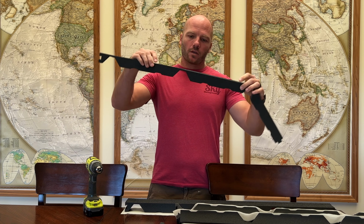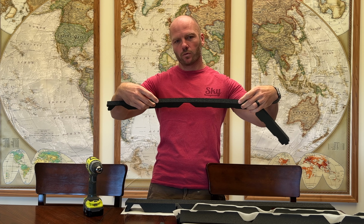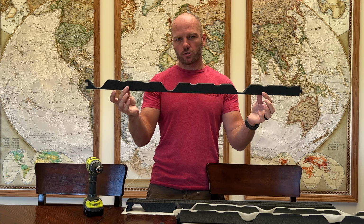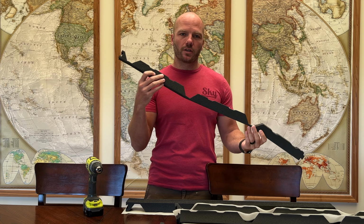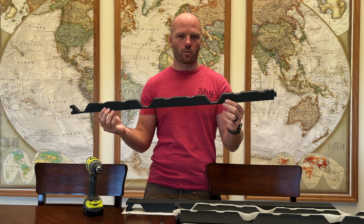On today's episode, we are going to be installing some ridge cap closures on a metal roof. These closures are the little foam pieces that fit underneath the ridge cap to keep water from getting blown up underneath the top edge of the roof. There are several different sizes of these foam ridge cap closures. I'll put a couple links for these in the description of the video. However, make sure you get the right size for your roof.